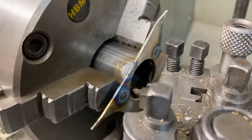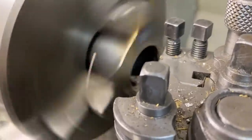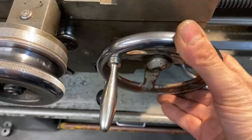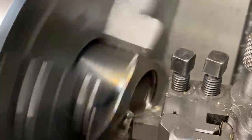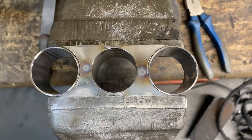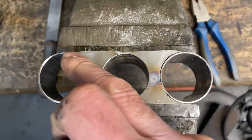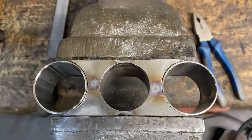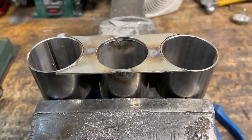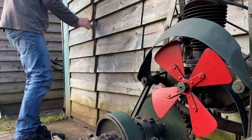That's the first stage of the trepanning operation to remove the centre portion, and now we can clean up the edges to make it smooth with the inside of the bore. With the central portion machined out, I position it in my vice and weld the outer and inner pipes to the back plate, making sure I weld all the way around so there's no leaks. I then take all the parts out into the garden to use my angle grinder to trim all the edges and make it smooth and ready for the next stage.